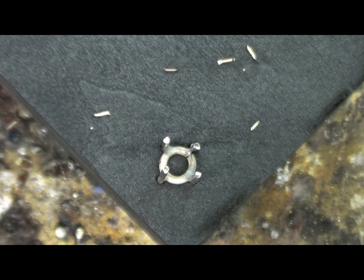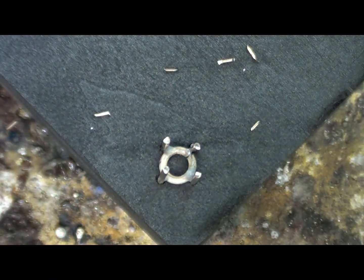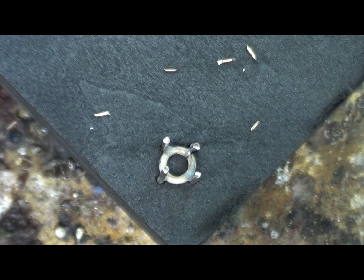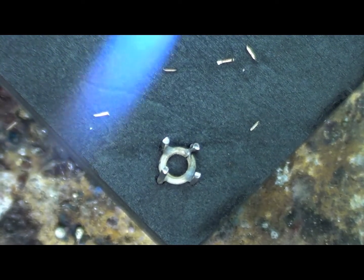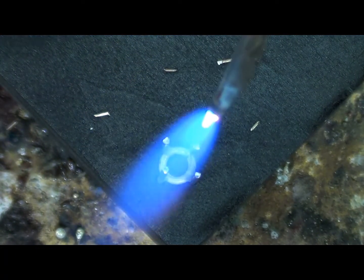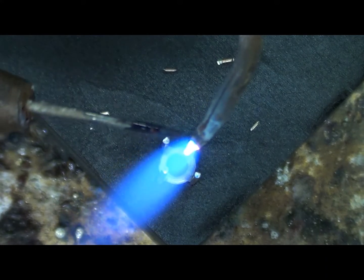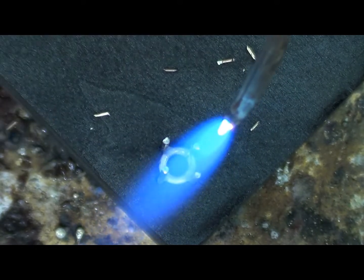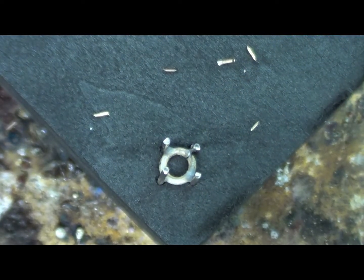So I just need a bit of flame. Small flame. The inner cone, you want about 3mm long — the inner blue cone, a nice gentle flame. That little blue section in here is roughly 3mm long. It's probably half as big as what you'd normally use for your other joins.